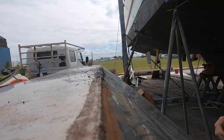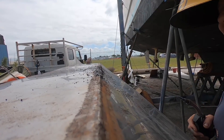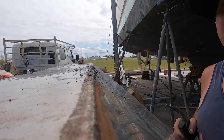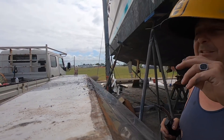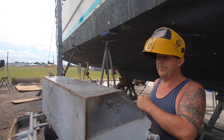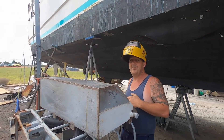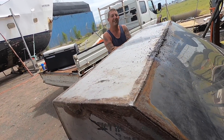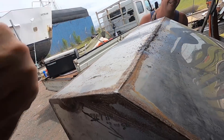There's lots of sealant inside — whoever had this previously put sealant on the inside rather than welding it up, so it might have just been a water tank. That's made welding harder, but Adrian's up to the challenge. He's got his nipple burnt a few times. Despite all the contamination inside making it a nightmare, the crack's been welded up. We're going to put some Sikaflex on the inside too.